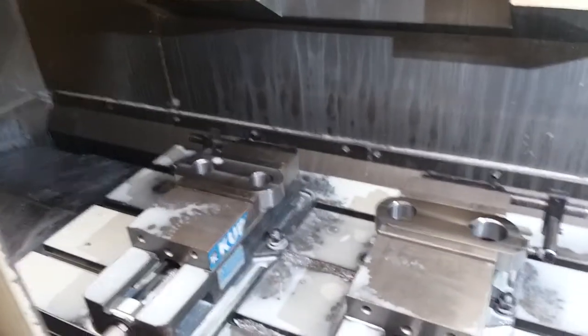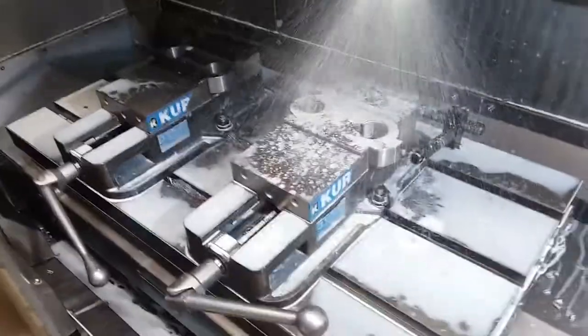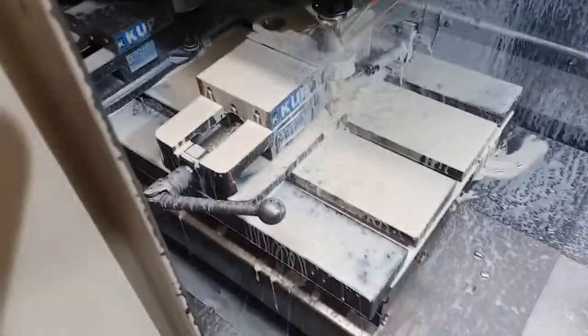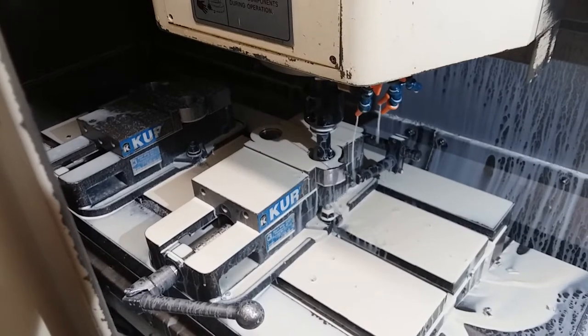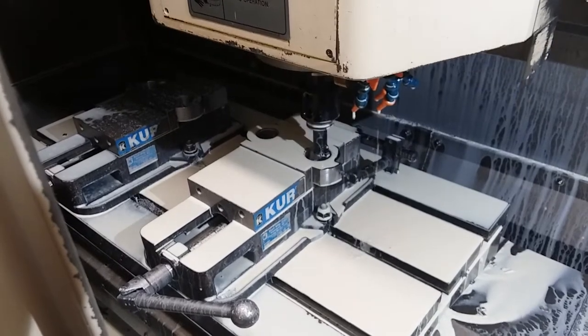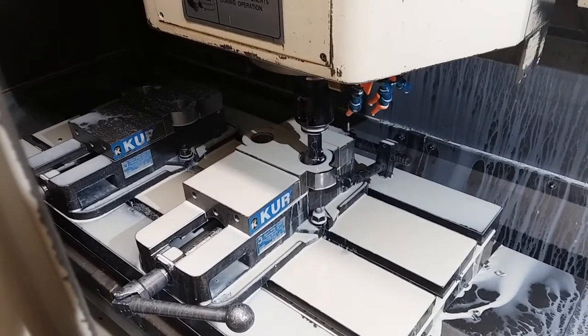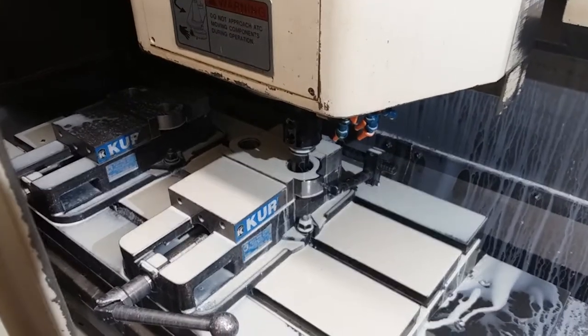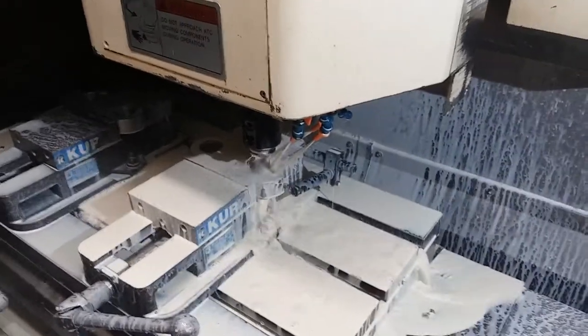Alright, so let's broach these parts on the middle, and you'll see what that looks like. I start on the side that I already broached on. This is 1018 steel. Step over is 2 thou, feed rate is 15 inches a minute. Turn the coolant back on, it's going to start cutting. And it just does that until it cuts out a keyway.